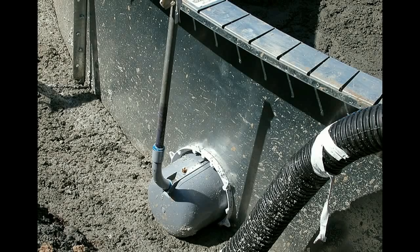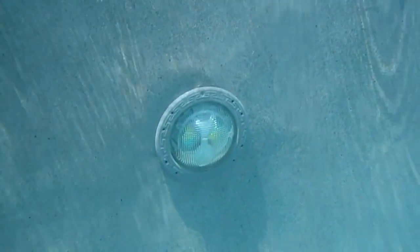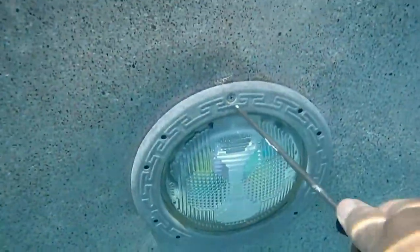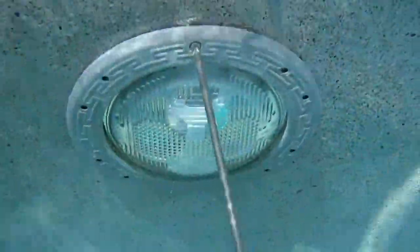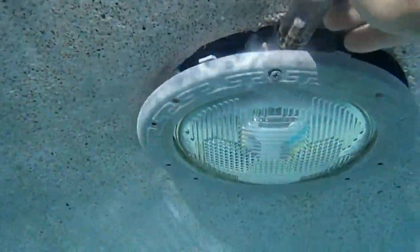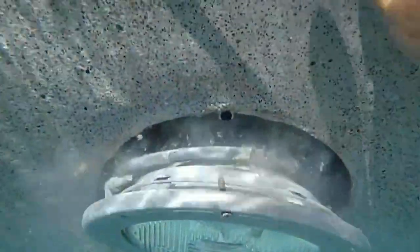So I'm talking about leaks and pool lights. For those of you not in the pool business, let me explain that behind the back of the pool there's a power wire running through a plastic conduit that's leaving the back of the housing, which leads to the breaker box. These lights run hot at 400 watts and need to be cooled by pool water circulating throughout the light housing. The light is actually surrounded by water in a watertight housing, sometimes called a wet niche. In most cases, the PVC conduit actually has water in it too.